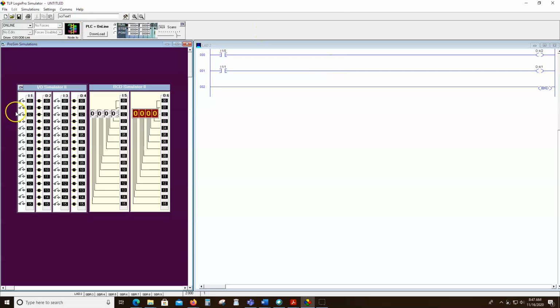All that is happening in any PLC is a computer. The computer is looking at that switch and it's saying, okay, yep, I'm receiving a signal from that switch. So this bit's going to turn on. And when I do that, I'm going to write a 1 in the data table indicating on. Because remember, when we're talking about discrete devices, they are either on or off. So this bit is now a 1. And we can actually look at that.